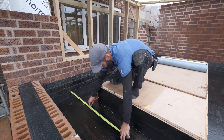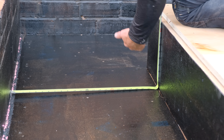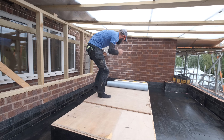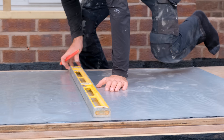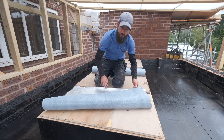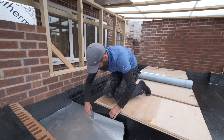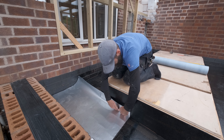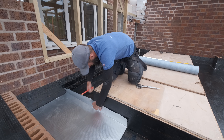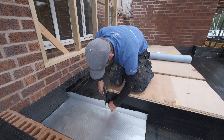So the first thing we're going to do is work on the flat area first, get all this flat area done, and then work on the detail and upstands. The first bit we want on is in this corner here. We're going to do it this way — 110mm. The gap is 600mm, so we want to go past this corner, about 50mm past it. We'll cut it at 700mm. We come over to this 700mm. This is the top bit — underneath you can see we've got some tape on it, and we're going to leave that on. We want to put a fold into this bit at the bottom of this upstand, get a nice crease following along the upstand. We're going to get the line where we want it, then cut it — not taking any tape off yet.